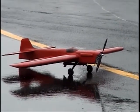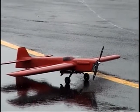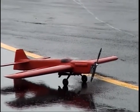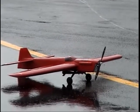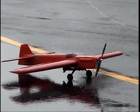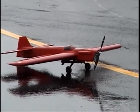Once you unload the exhaust, it totally changes the character of the engine. It turns the engine into a monster. And the only way I can do it right now is this, plus I know now I've gone too far with the tank shim. I went 1/8, I really should go half of that amount. So I'm going to keep cutting it in half till I get it right.